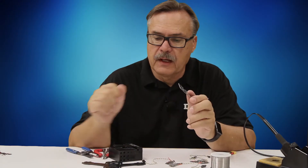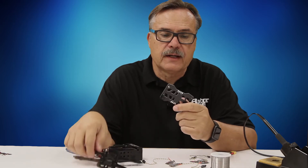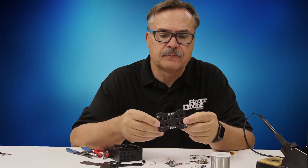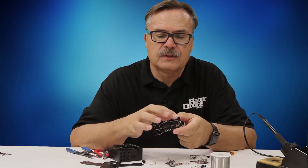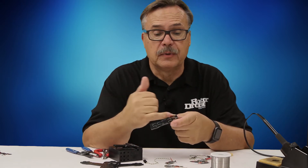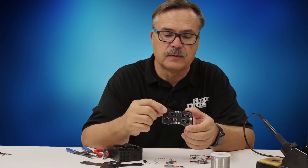Most of the time when you get your drone, you're going to have all kinds of pieces. You're going to have the mainframe, and a lot of times you're going to have what's called a power board. This sometimes will have the lights in it, but it will have these little tabs that you're going to have to solder your ESCs to, your power plug, and any other auxiliary plugs — like these two auxiliary spots for the FPV equipment, so that you have your video transmitter with power.